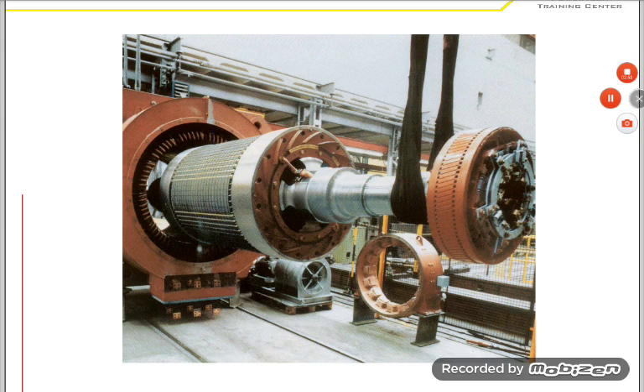Do you transport the whole excitation current over one brush? No — you don't have only one brush. To transport all of it, because you have a maximum excitation current of 3,000 and something amps. You cannot transport 3,000 amps over one brush — that's not possible. So what you do is you have many parallel brushes. That's the parallel connection again. So you have many parallel brushes.